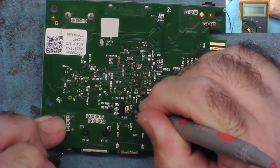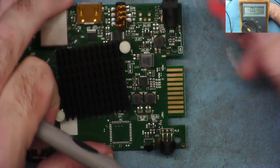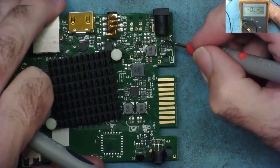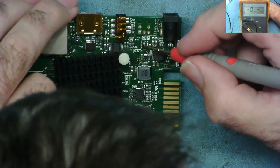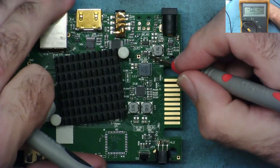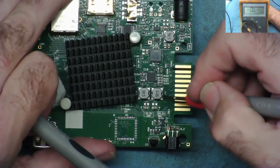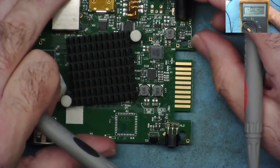Okay. So what you'll have here is your 12 volts coming in, and then there'll be some controller chips for these various VRMs. The controller chip will probably be that one, that funny thing there. This thing with 5 pins might be one. Or maybe this chip here might be one, and then I suspect this chip here probably drives these two. That's my initial take on it.